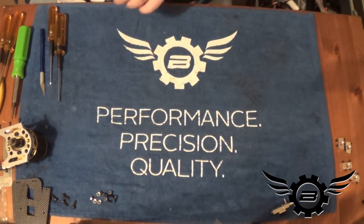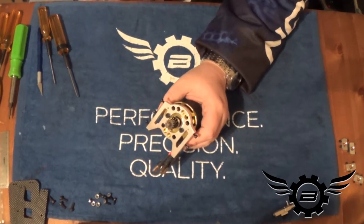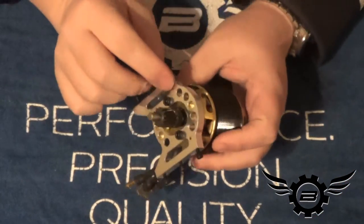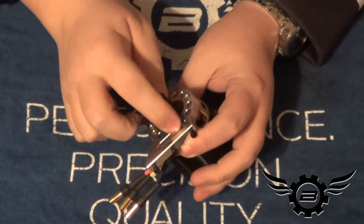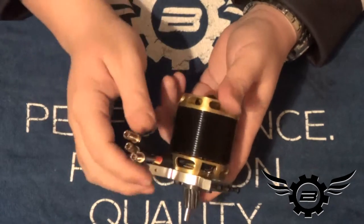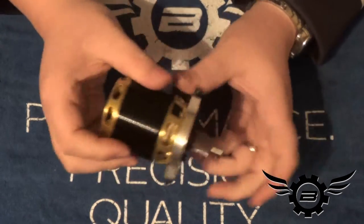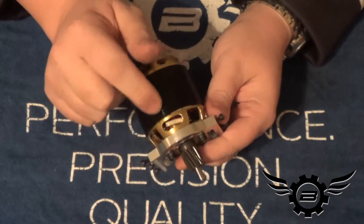One quick note about the motor and pinion — I did get the motor mount on. Let me zoom in a little bit for you. I used red Loctite on my 4×12 bolts, snugged everything down nice and tight. Quick note about orientation: in the helicopter, the rounded side goes towards the main gear.